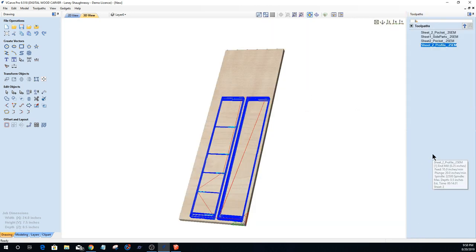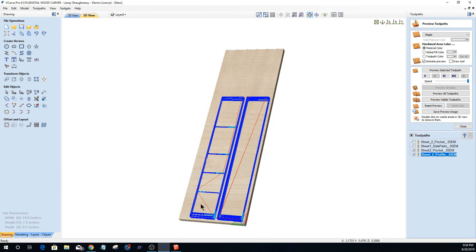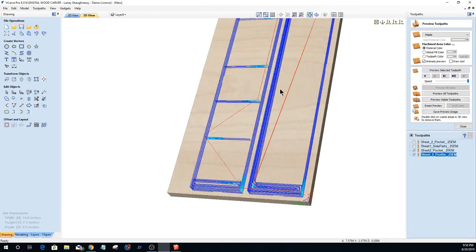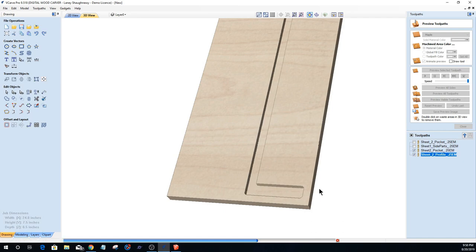Let me go back in there. Let me put my ramp in there. Just doing a 1-inch zigzag ramp, calculate that. And so for those two parts, let me turn my preview quality down. We'll go standard so it's a little faster. That should rip through,